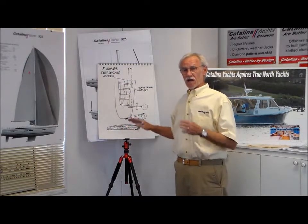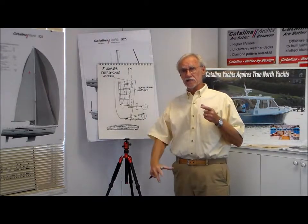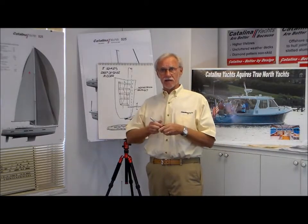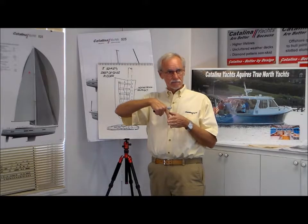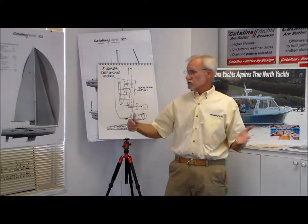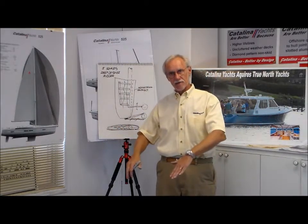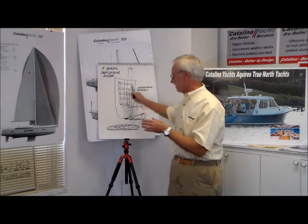The beauty of this is we've now physically attached the rudder core to the rudder blade skin. Every other rudder in the world — and we used to make them this way — is a bit like a popsicle stick. You put the stick in, the popsicle freezes, and the only thing holding that stick in place is attachment to the ice on the inside. That's okay for popsicles, but not for rudders. The way everyone built rudders was to have symmetrical skins, put the core in, pour foam in, slam it closed — and that was the attachment. The foam held the core in place. We wanted to get away from that, so that's why we heavily glassed these.